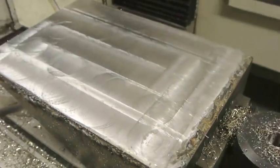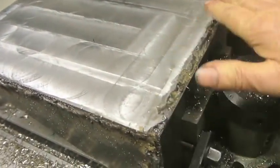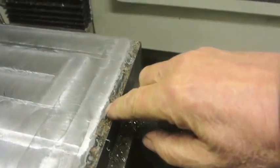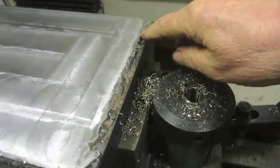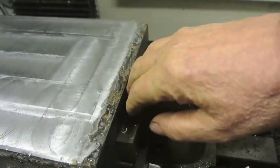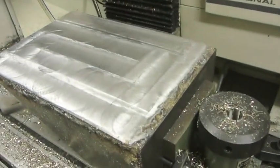There you see the finished surface. There's just a little bit here that's not machined - I'll blend that in and grind these down a little bit. But the welding here is extremely hard, you can see it's very bright, it seems to be extremely tough stuff. I should have maybe heated everything up before I started machining it, but the cutters cope with it OK - it just makes a lot of noise.